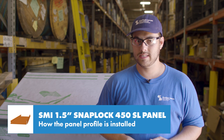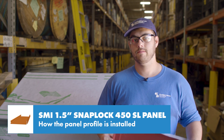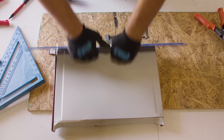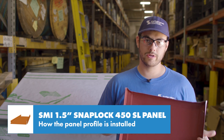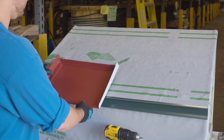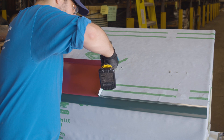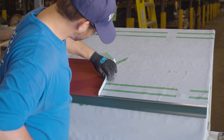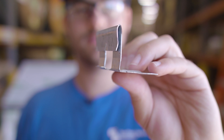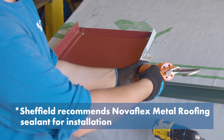Next let's look at how this goes down on a roof. Make sure to follow any installation guidelines or requirements available. I've already fabricated these panels with a 1-inch bend at the eave and a 1-inch box at the top, but if you want to learn how to do it yourself there are a couple links in the description below. On the deck the panel hooks onto the eave, is pinned on the box end with a couple fasteners, and uses fixed clips on the male leg. If you're following a UL-90 construction number make sure you use a clip that's approved by that assembly. This bead of sealant prevents siphoning of water at the end of the panel.